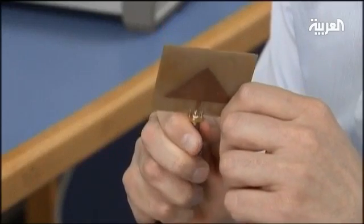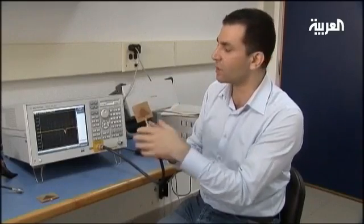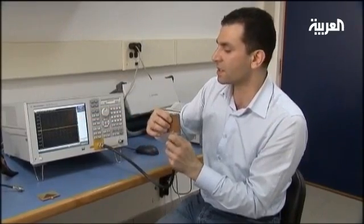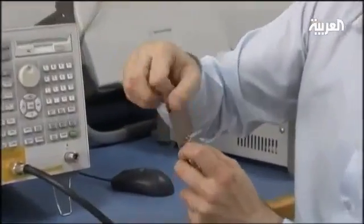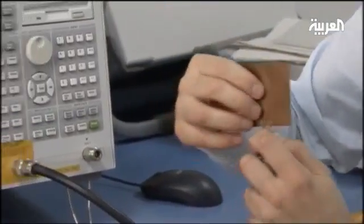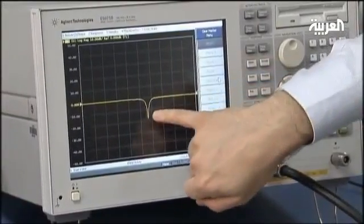He added that the frequency of the antenna could be manipulated by a switch, facilitating the connectivity of wireless devices such as the mobile phone. The switch is either on or off. When we change the state, the frequency moves from one part to another part, corresponding to another case of the same antenna where the switches are different. As you can see, the frequency shifted — so here we got operation at another frequency.